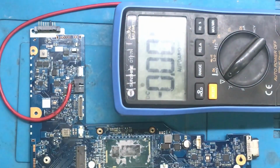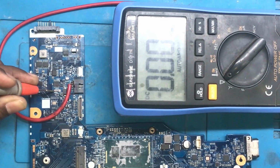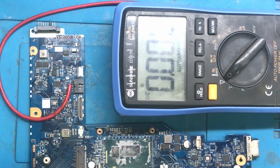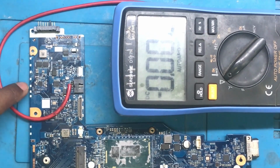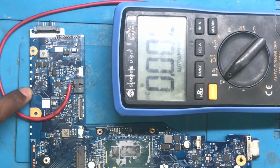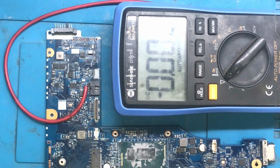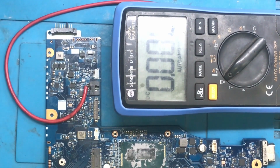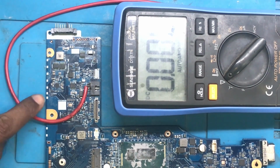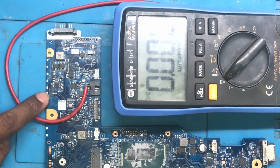Okay, if you check here, 20 volt 16, here also 20 volt 16. Now this circuit has become functional. So as I told you, the IC is releasing ACPRN and PSCIN, which is coming from a circuit. The circuit is here. This is the circuit. Now let me show you whether we are getting what we were supposed to get. So we are supposed to get PSCIN from PQ994B, PQ998B, which is here at the gate, at pin number 3.